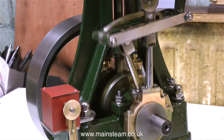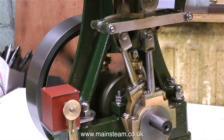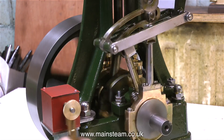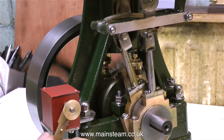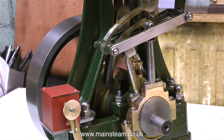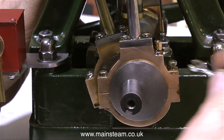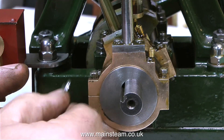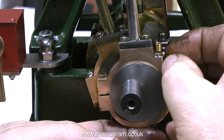Whenever I build or rebuild a steam engine, I always try to spend plenty of time running it in properly. It's very important — if you do it wrong, you can actually wear the engine out during the wearing-in process. The secret is plenty of oil, and don't over-tighten the bearings to start with. When the engine's been running on the bench for about a week, maybe an hour a day, then you can start to tighten the bearings slightly — but don't over-tighten them, because you can do a lot of damage if you're very ham-fisted. There are no torque wrenches required at this scale; it's all done by feel.